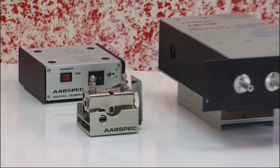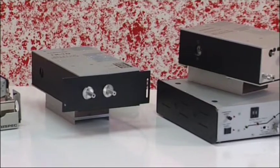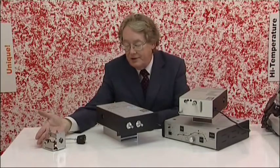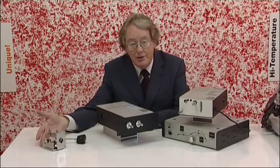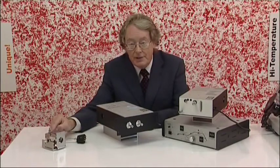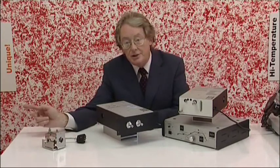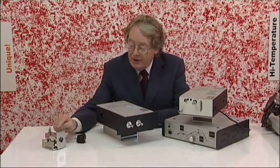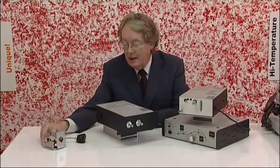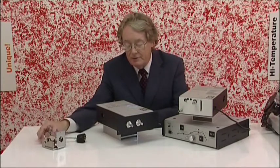This is our selection of GC-FTIR interfacing systems. There are three different families and within each family we have different options. The first method of GC-FTIR that we offer is discrete component GC-FTIR — this is perhaps the most popular. Here we have a short high performance solid gold light pipe that drops into your sample compartment and couples back with a heated transfer line to your GC. You can also have a return line that brings the gases back into the GC for further analysis. This is available in three different versions to suit different detectors and different chromatography methods.